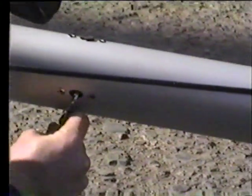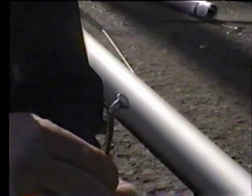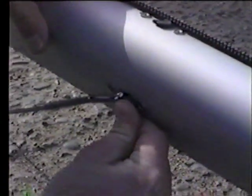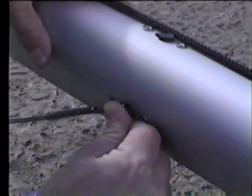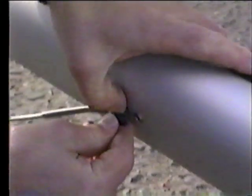Once you have that complete, there'll be a T-ball fitting. The top of your side stay has a small T-shaped unit. You can see that it's got a small T-shape which will only fit through the socket hole when it's aiming in a certain direction, so you've got to line that up and pop it through, then twist the T down. There will then be a small black rubber plug which you wedge into the top portion of that T socket, just to keep that T fitting from coming loose during a capsize or while you're at the pier and there's no tension on your rig. Simply force that little plug in there — it can be tricky, so have patience. Sometimes a squeezing and then a twisting method will get that in most easily. The same process goes for your lower side stay, which is attached right below your spreaders on your mast.